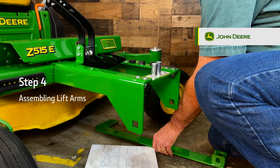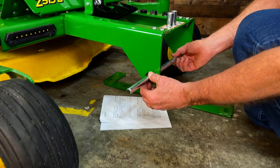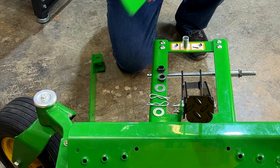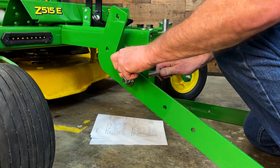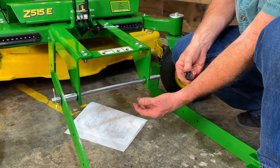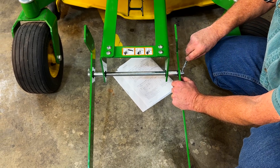Step 4: Assembling the lift arms. Assemble the two lift arms to the mounts by first sliding the axle through the square hole at the bottom front of the latch weldment. Add a nylon square bearing to the outside of the axle, placing the square extension into the square hole. Add a metal spacer and another nylon square bearing. With the wheel extensions facing to the right from a driver's point of view, add the square hole in the lift arm to the square bearing. Add a washer to the end of the axle on the other side of the lift arm and a cotter hair pin to secure the axle. Then pass the axle through the other side, adding another square bearing and passing the square part of that bearing into the lower front hole of the latch weldment. Add another metal spacer and a fourth plastic bearing with the square extension facing outward. Add the other lift arm assembly, also with the wheel extensions facing to the right. Add a washer and secure this end using a hairpin cotter.